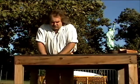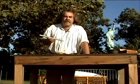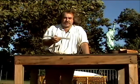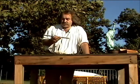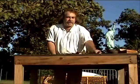Now, it's not a normal glue. It's a very, very solid glue, but you have to heat it up to about 450 degrees before it turns into a liquid. And that is simply this. This is solder. It's half lead and half tin. Now, the technology on this hasn't changed much in thousands of years. If you go to Rome, to the aqueducts, they essentially sealed the seams on the aqueduct with lead, and they just poured it in by heating it in a little cauldron like this, and it worked very nicely.